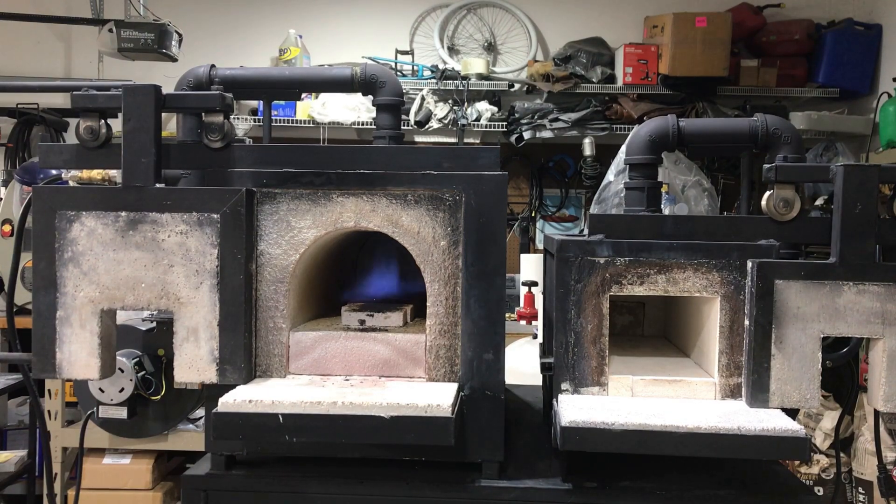So there it's lit. It'll start heating up. It'll take about 20 to 25 minutes to get up to forge welding temperature because of the volume and the mass of the forge itself. But once it gets up to heat, I can actually back the gas pressure down a little bit and maintain that forge welding temperature of around 2,200 to 2,300 degrees — depending on what kind of steel I'm using and what it needs for forging. I'll close the door on it and let it start heating up.